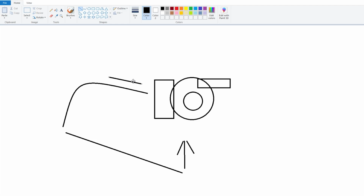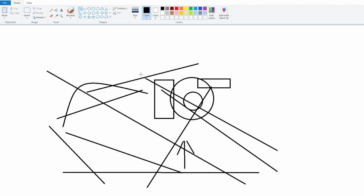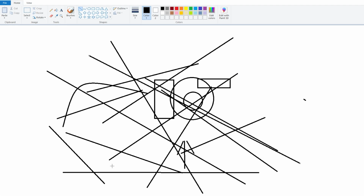So we've got the pie cuts right there, got the bend right there, and then we got the straight line just there. So we need to figure out a way to make sure this clears all the intercooler pipes, because the intercooler pipes are all in the way and they're causing a lot of problems because I have a top mount on a Lancer.